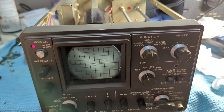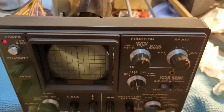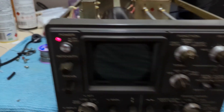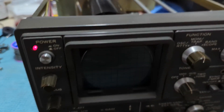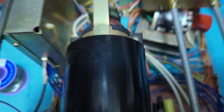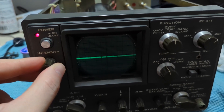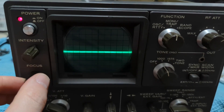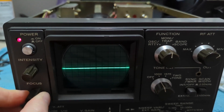Going straight into the power-up. Let's turn this upper light down a bit. 240 volts on the Variac - power on. There's power on the tube. I was not able to adjust the intensity before. The all-important trace - is the trace adjustable? Yes, it is. There we go. Could not do that before, but we can now.